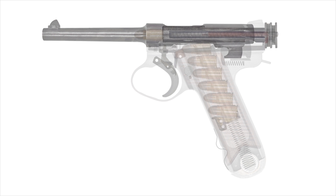Back to that lockup. A T-shaped block hinged to the barrel extension holds the bolt in place. When in the up position, this locking block sits in a notch in the underside of the bolt and prevents it from moving without the barrel extension.